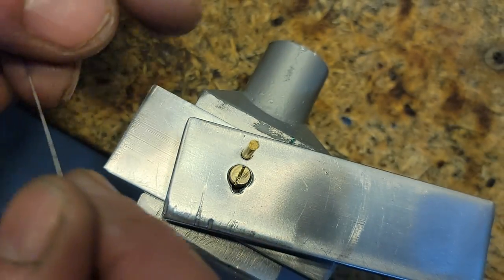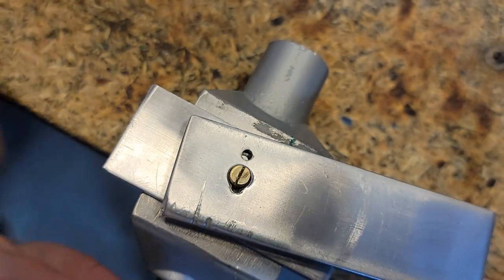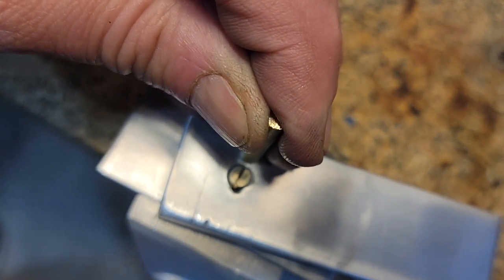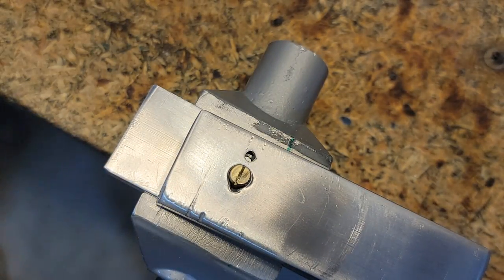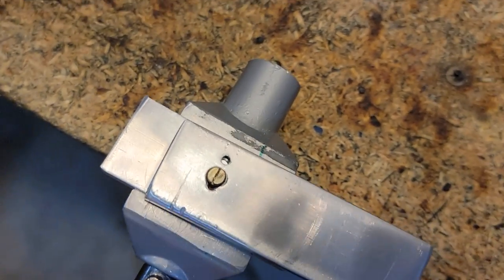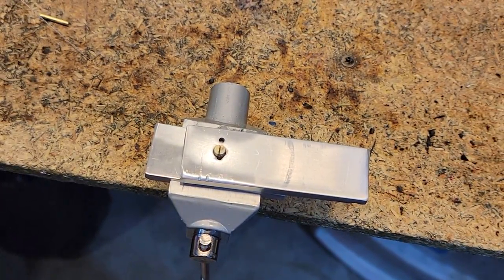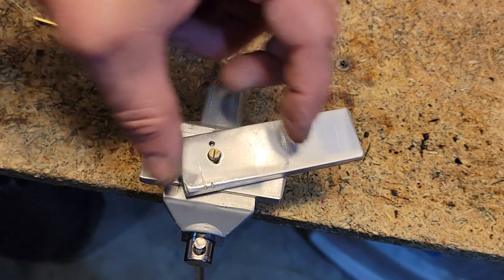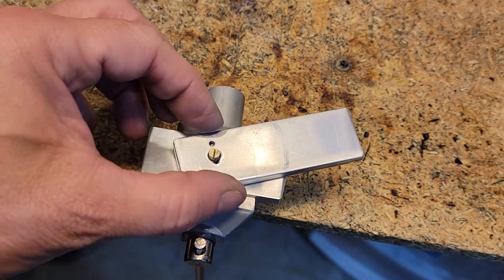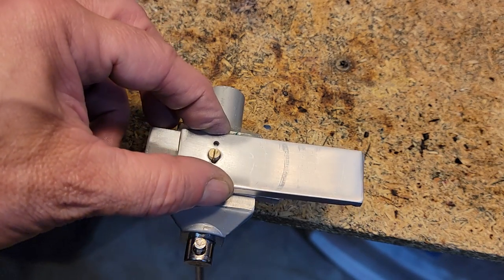What I can also do is take this guy on the lathe and turn him down just a bit tighter on the end, so I have a little peg to put in there. This is just our first try. I think we'll go ahead and do more and improve it. Now that I know it's as easy as drilling a couple of holes and not messing around with taps and dies, this will be a very handy tool. I'll probably take my scribing pencil and scribe on here various angles — that would help me get the front handrail of a locomotive right. You need a couple of really good bends and they've got to be the same.